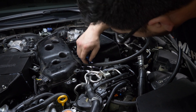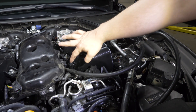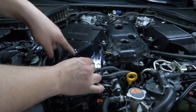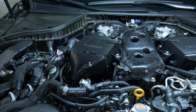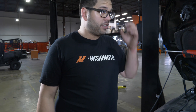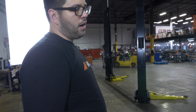Initially, it looks really good. This fits really tight down into the valve cover. The valve cover has a little gully where this goes, and the stock one uses that gully just a little bit. But what I did was push these down as far as I can, because they're a lot bigger — I pushed it really far down into the allowable area of the valve cover. You can see there are some cutouts to allow for the stock one, and what we did was just utilize that space a lot tighter, so we could make it thicker. Even now, we're going to have to push the engine cover up about 15 millimeters, just taking up the space between the engine cover and the bottom of the hood.